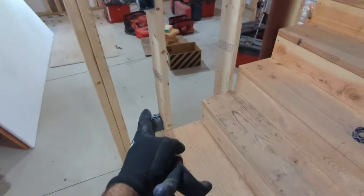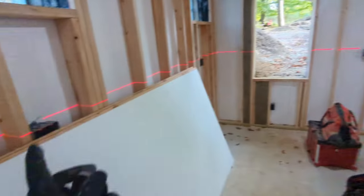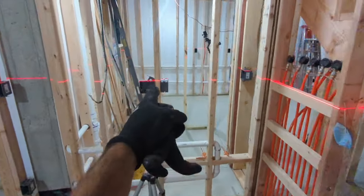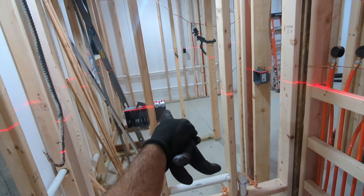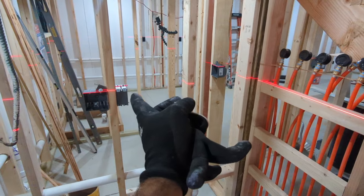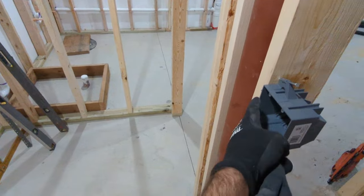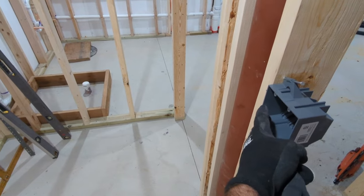Then within that, if I'm up and down in a space, well, then basically as you look at these, in almost every case, they're tagged down to the right-hand side, right. That's a left, but that's right. That faces us on the left-hand side because on the other side was where it made more sense to have the ground fault circuit outlet right over the vanity. That will also be protected by one, whether the actual item with the ground fault protection is there or there remains to be seen. Actually, I think as far as the bathroom's concerned, you come in, you make a left, you got the main bathroom light, and then you have the vanity light. One of the main lights ought to be slaved to the fan.